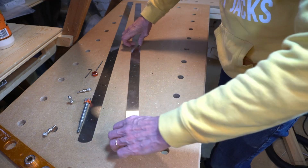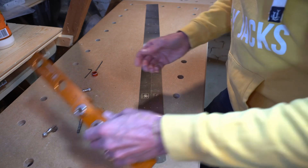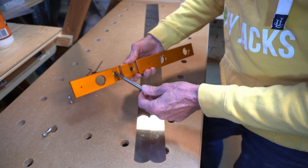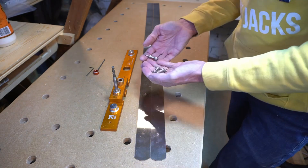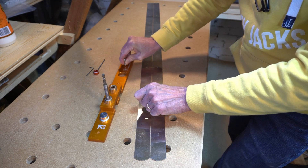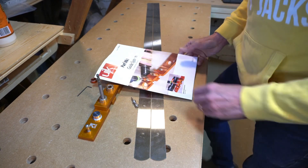In the packet you get two one-metre rules with 3mm holes at 96mm centres. You get the jig with three dog holes, three pin holes, and two holes which receive the drill bit. You get two dogs which sit in the jig, and three pins which work as the setting out for the rule and also for the jig. A drill guide with a 3mm hole, a 3mm drill bit, a depth stop for the large drill bit, and an allen key to tighten that up. Lastly, you get a set of instructions.